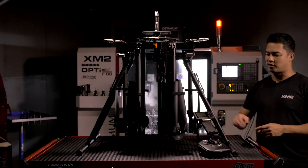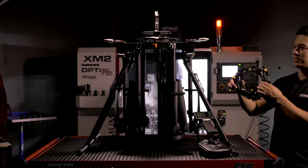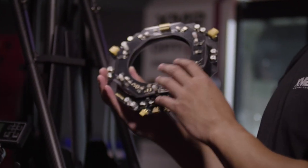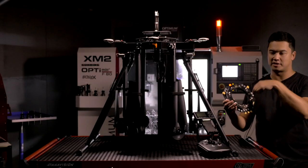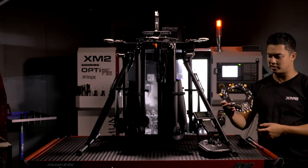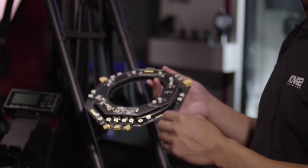We've actually built our own power distribution board. The vibration dampening goes through the middle, and it's designed to be really easy to use and maintain. We've built in current sensors which feed into the telemetry system, with screw terminals and signal terminals on top. The two boards are separated so if there's a problem with one you've got a redundant system. The propulsion system also has a redundant signal system so if there's a problem with one of those small servo wires it can jump over — another safety feature built into this drone.